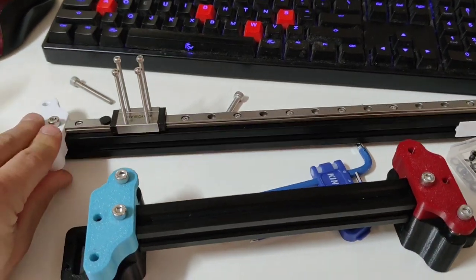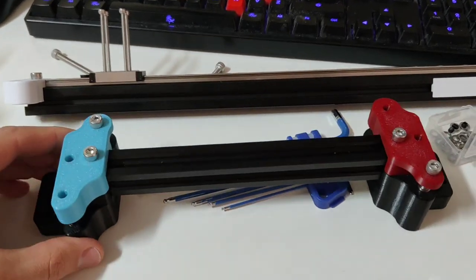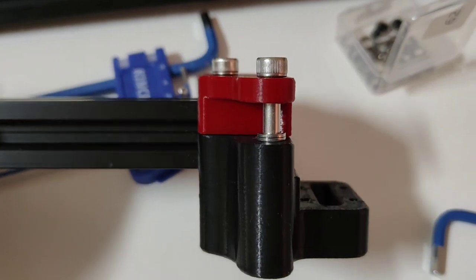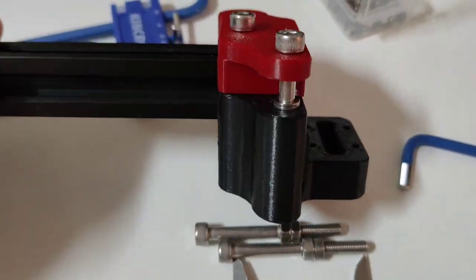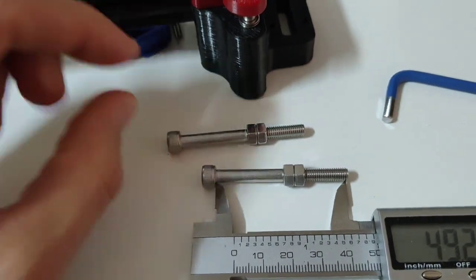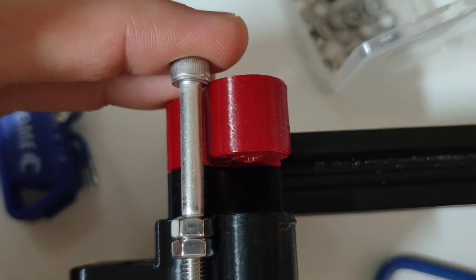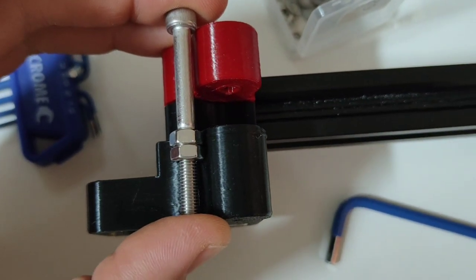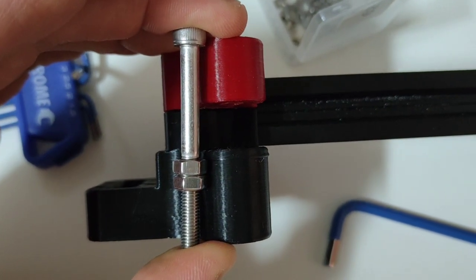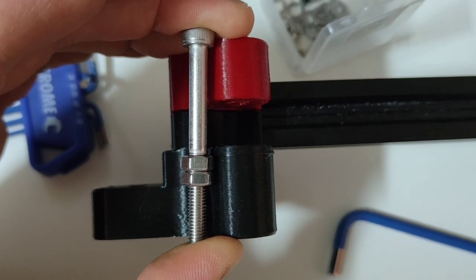Got our development happening on our top axis X rail. I've just got it sitting here on the small gantry. Got our washers in and I've got our pin bolts. I might actually use these bolts over pins because these things are really cool. The one I need for this side here is 40 mil. So these are actually a 50 mil bolt, but once we cut them down to 40 mil in length, they will be awesome. And we've got the full shaft covering where the idlers and the tooth teeth go.